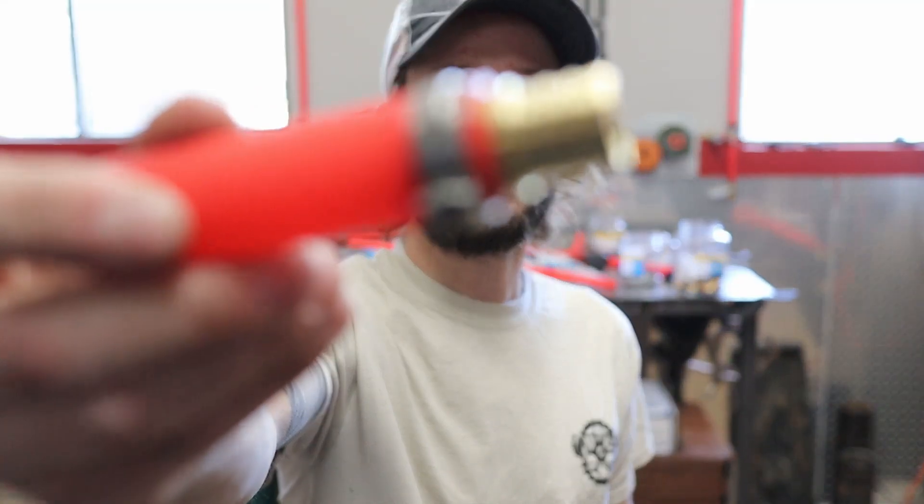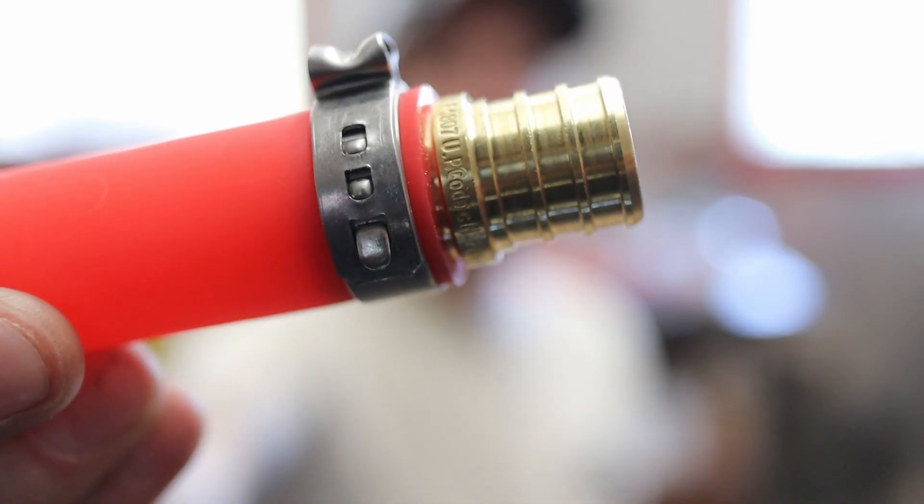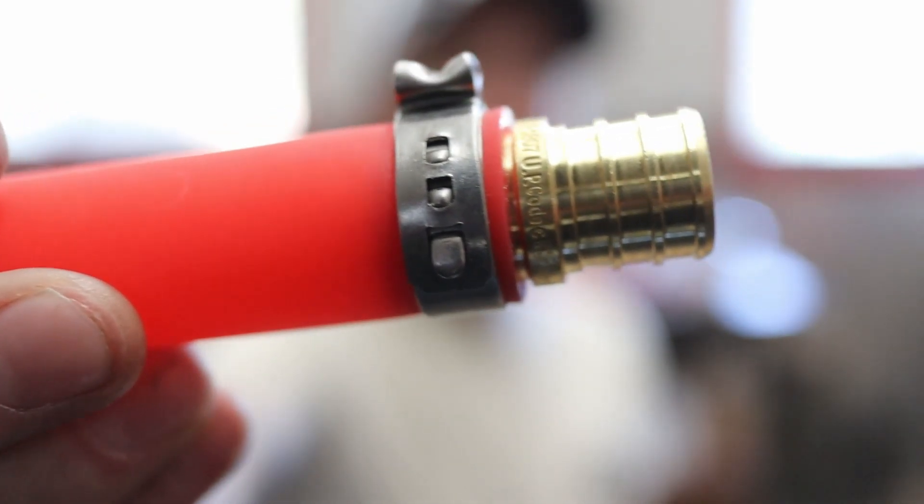It is calibrated to crimp to the perfect amount and then you should have a leak-free fitting — it turns out pretty clean. I didn't want to use SharkBite fittings because they're not as slimline as this; they kind of stick out and they're not as clean in my opinion, though they're a lot easier. So I went with this system. Cost me about 500 bucks to plumb the whole shop and it should work pretty well. I will let you know if I have issues with it naturally, but I'm hoping I don't — crossing my fingers.